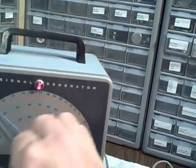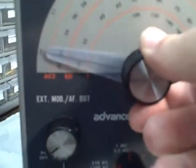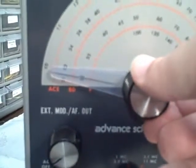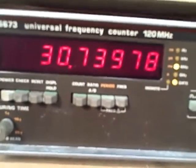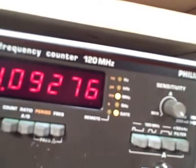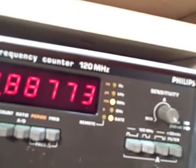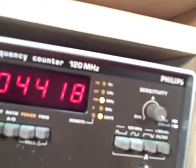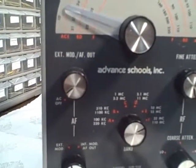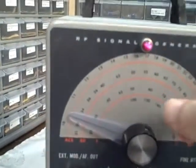Band F — this was the toughest band, always is. At 32 megacycles we're getting 30.73, so a little off. To get a perfect 32 I'm actually reading more like 33 and a half on here, so off a little bit on the Band F low end.